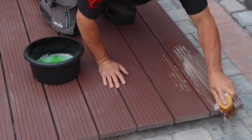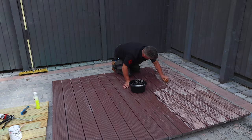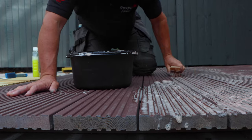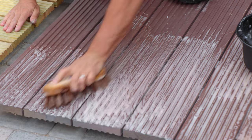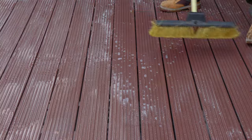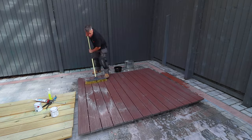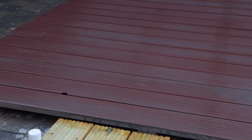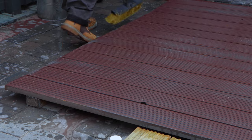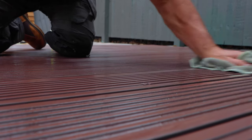I'm using a hand scrubbing brush — this allows me to get in between all the grooves on each plank, making sure I remove all moss and algae. Then I mix up some concentrated sugar soap with warm water and scrub the planks down. If you have a jet wash, it's ideal to jet wash the area to rinse off the sugar soap; if not, this can be done with a couple of buckets of clean warm water. Ensure your surfaces are completely dry prior to painting. I'm going to leave this to dry because external wood surfaces can retain moisture for up to 48 hours after rainfall or preparation.